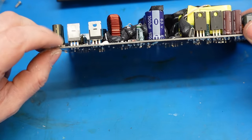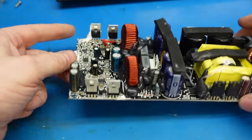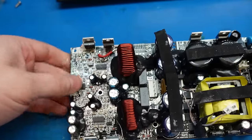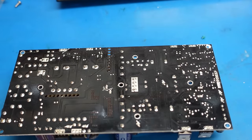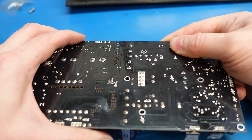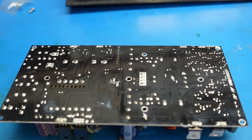You have to watch out for this — there's heatsink compound on the back of these transistors and all around the sides, gets it all over your fingers, it's right mucky, especially around here where they've gobbed it up near a little temperature sensor. Anyway, let's see if we've got any trouble at the back of this. Oh, that looks a bit dodgy. There's a line around it — yeah, I'm suspicious of that. I think that's a dodgy joint; I'm just going to touch that up with a soldering iron.